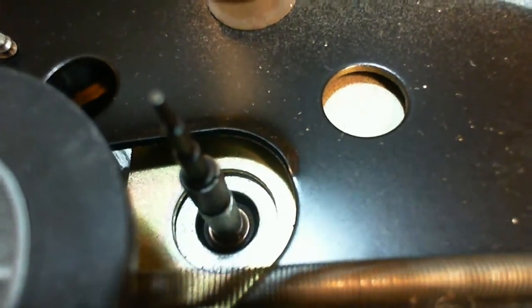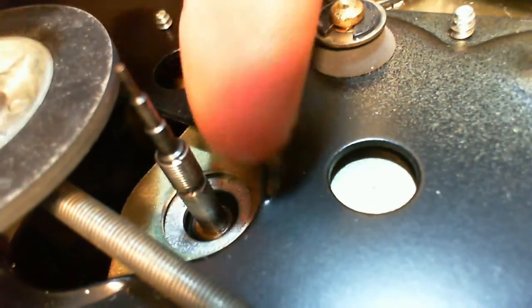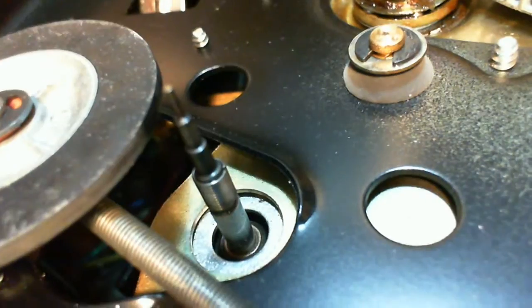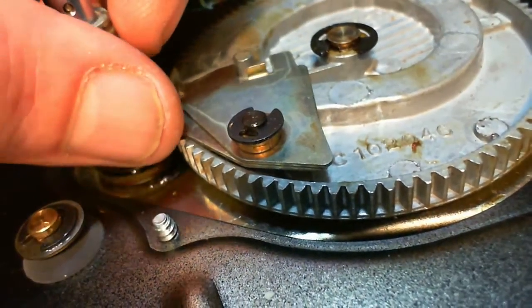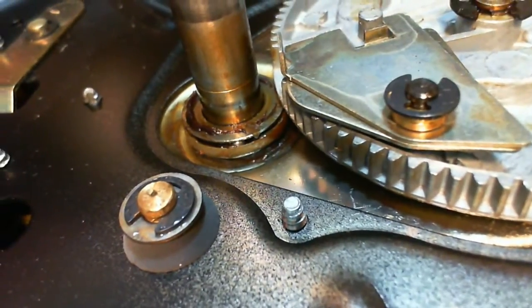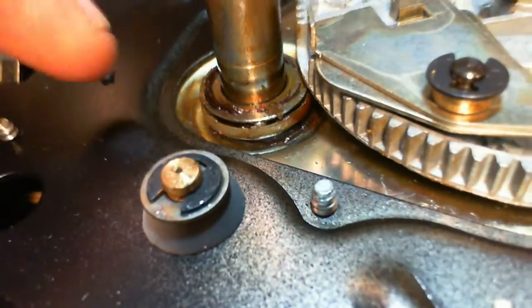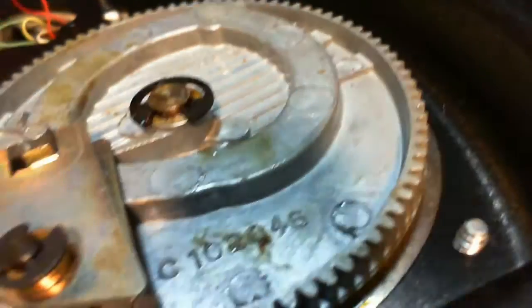Oh, look at that spindle on the motor. Down, yeah, it looks like moisture all over it. Yeah, not the best thing. Okay, so here's the pieces of metal that are sticky. They move, but I can tell they're not floppingly loose. It might work like this. They certainly should be cleaned up. Get all the oil that might be on them off of it. The main bearing, well, it's pretty brownish in here. But look, there's no lack of oil and gook down here. Not bad. You see all kinds of moisture on the surface of this. So it has collected a fair bit of moisture.